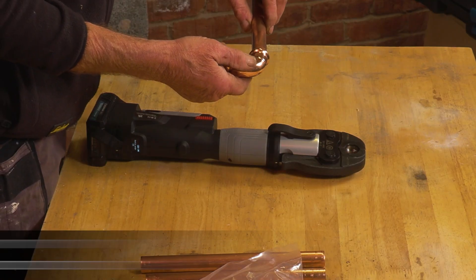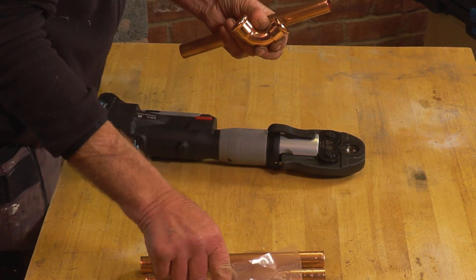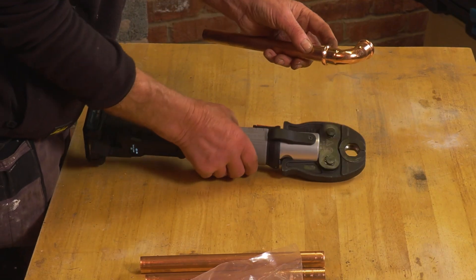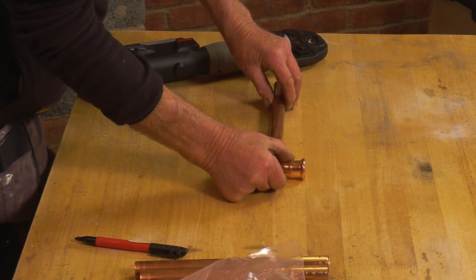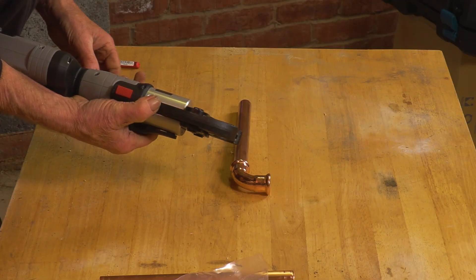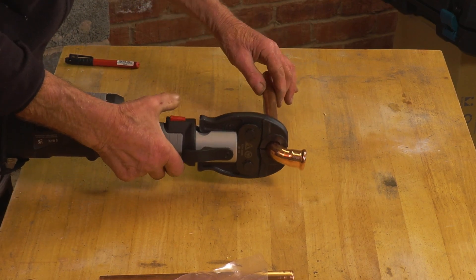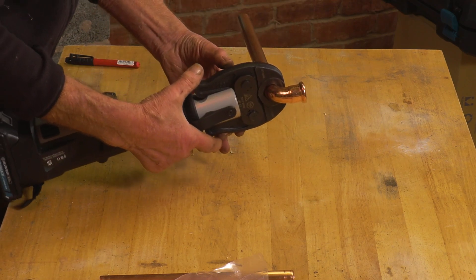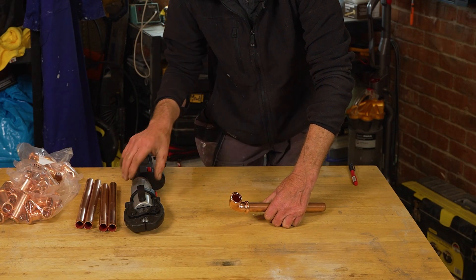For those not familiar with press fit, the first thing is to seat the joint correctly. There's an O-ring on the inside, so it's important to keep your fittings clean and in some kind of container so you're not getting grit. I like to put a little witness mark on the pipe because that way I can always tell if something starts to drift out, but they stay in position nicely when they go in. Press the fitting up against the shoulder, press the trigger — you hear it go — and when it releases you can undo the jaws. That fitting is made absolutely perfectly and secure.